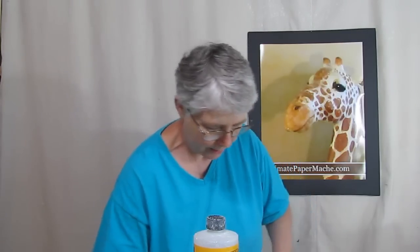What I'm doing with it — I did a whole lot of research and it turns out that since this is a fiberglass reinforced cement, it's basically the same system used by Buddy Rhodes, the concrete countertop guy. What he suggests is first mixing some acrylic fortifier in with your water, which I'm going to do right now. I use it about half and half. I haven't really seen any formulas for it. You buy this at Lowe's too, and it's not terribly expensive.